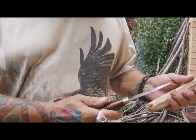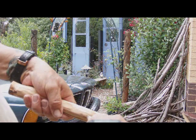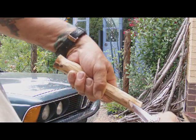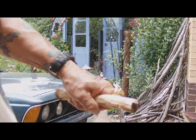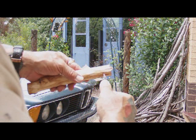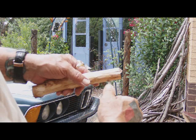And then, with a fine pointed blade like this, we just commence to bore, using an auger action. Slowly boring ourselves into the wood, so that the cutter in the action digs away. So now we're digging away nicely, and this is the commencement of a good hole. See? Now, of course, we want the tip of that blade to reach about there. So we have a bit of a distance to go, but it really doesn't take much time at all. Hardly any effort.